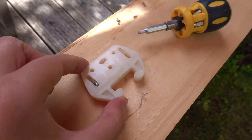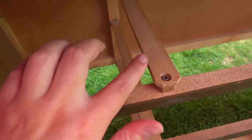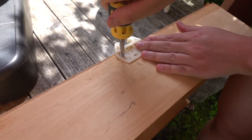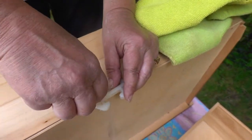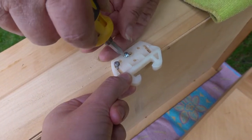Some of the drawers have missing screws on their sliders and they're a little loose, and one of the bars for the drawers is actually off its rails, so we're going to fix that up now. Some of these stoppers came off the rails — they're supposed to be attached to the drawers so we're just going to reattach them. We're also trying to find screws that are the right size because it looks like they may have replaced the screws at some point — these ones are different and a lot longer and they go through the drawer, so we're trying our luck with some extra screws we have.